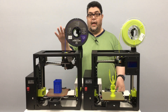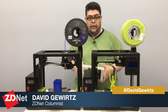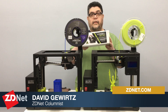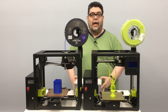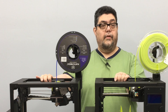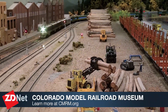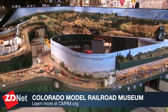So far we've taken a look at the Lulzbot Mini and the Lulzbot Mini 2. But what we're going to do next time is even more exciting — we're going to look at the capabilities of the Aerostruder V2 Micro print head, which replaces the standard print head on the Lulzbot Mini 2. Its purpose is to do very highly detailed prints, something that FDM — fused deposition modeling — printers are normally not able to do. Stay tuned because with the help of the Colorado Model Railroad Museum, we're going to take a look at what we can do with the very high detailed capabilities of the Micro Aerostruder.